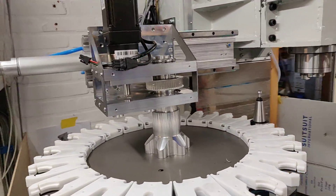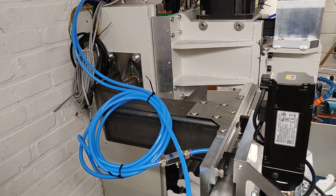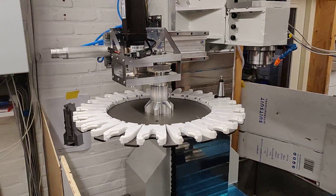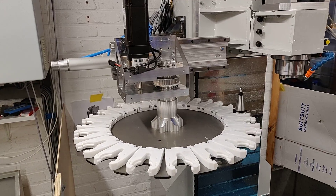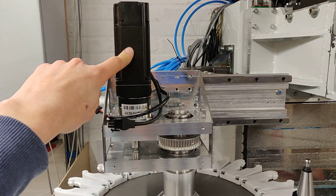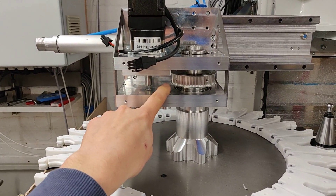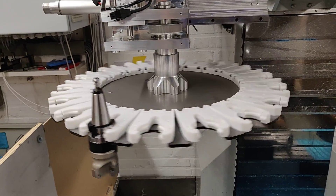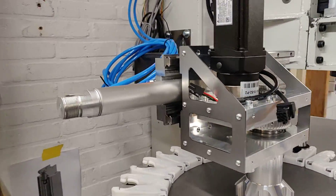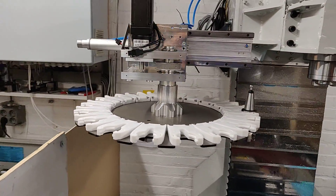It's completely made of aluminium. There's a big arm made of steel tubing to hold the whole tool changer. It's an 18-position umbrella-style tool changer driven by a 400-watt servo with a 1-to-10 reduction, and then a 1-to-2 belt reduction to spin the disc. There's a pneumatic cylinder to push the carousel in and out, like all tool changers work.